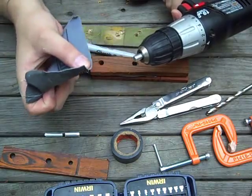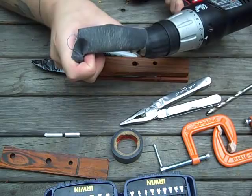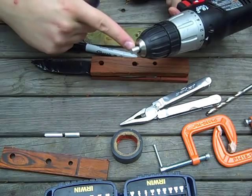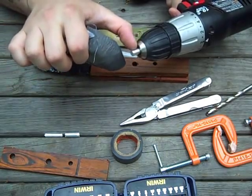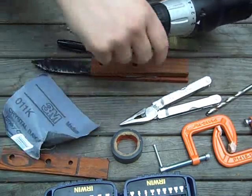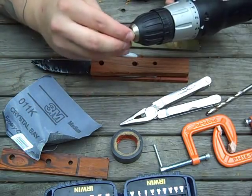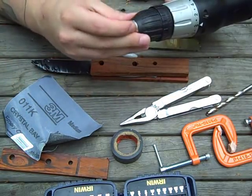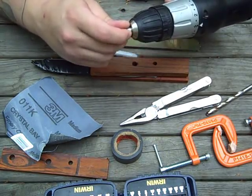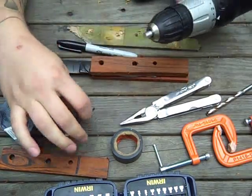What I also like to do is groove the entire pin so the epoxy has a lot more surface to grab hold of - it seems to work very well. It pits and grooves it, similar to threads. You can run your nail right over and see how much it's grooved. I'll do one side like that - I've done exactly half of it.